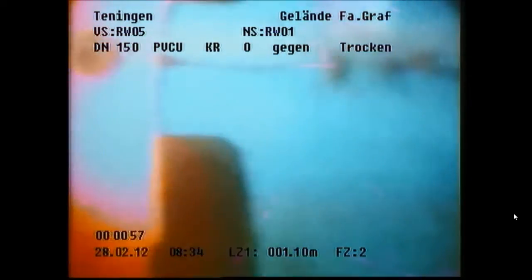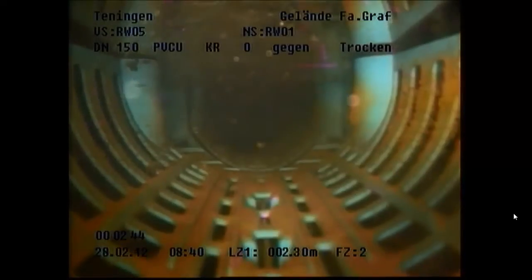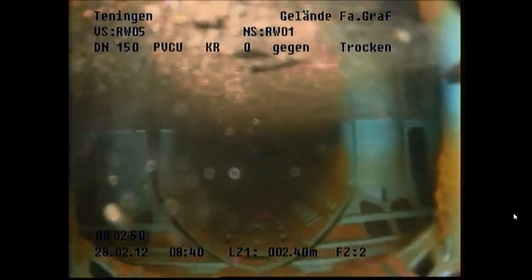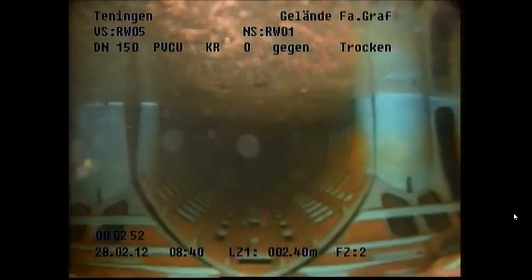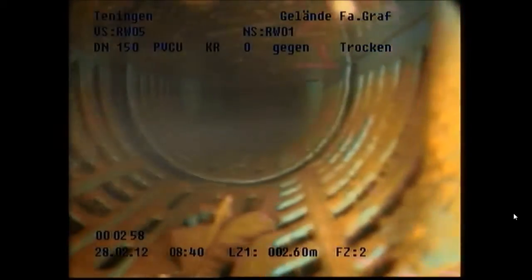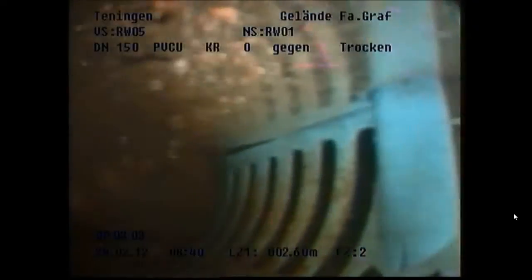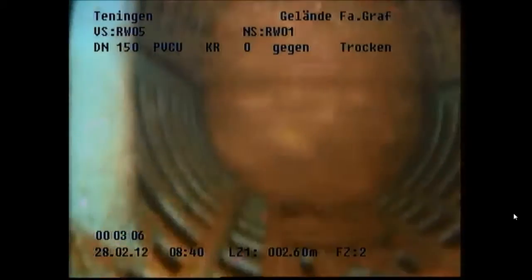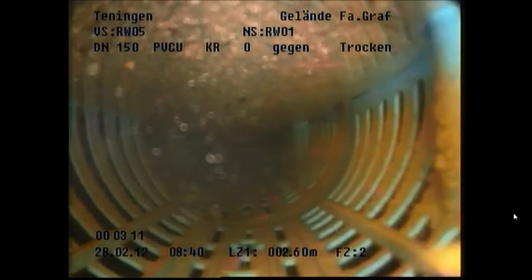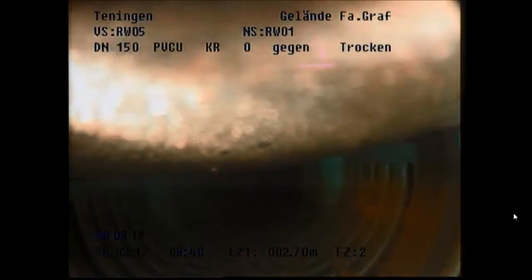As the camera settles, it will travel along the bottom of the rainblock inspect units. And you can see what you're able to look at inside the attenuation tank. As you can see, there's a bit of silt along the bottom of the units. I don't know how long these crates have been in, but that will build up over time. It's important to have filters and sediment baskets and filter chambers prior to the tank to limit how much silt comes into the tank.